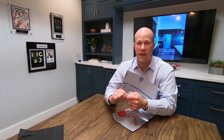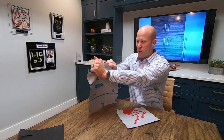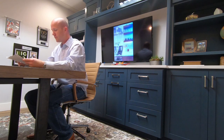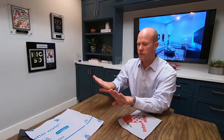The best thing about this though is the rip test. You cannot rip this — I mean really, I'll usually have someone grab onto it on the other side and I'm really doing my best to rip it, and you can't rip this. That's the best reason for it. So we only use a synthetic underlayment, and in the valleys where two roofs come together, we actually use a peel-and-stick called an ice and water shield.